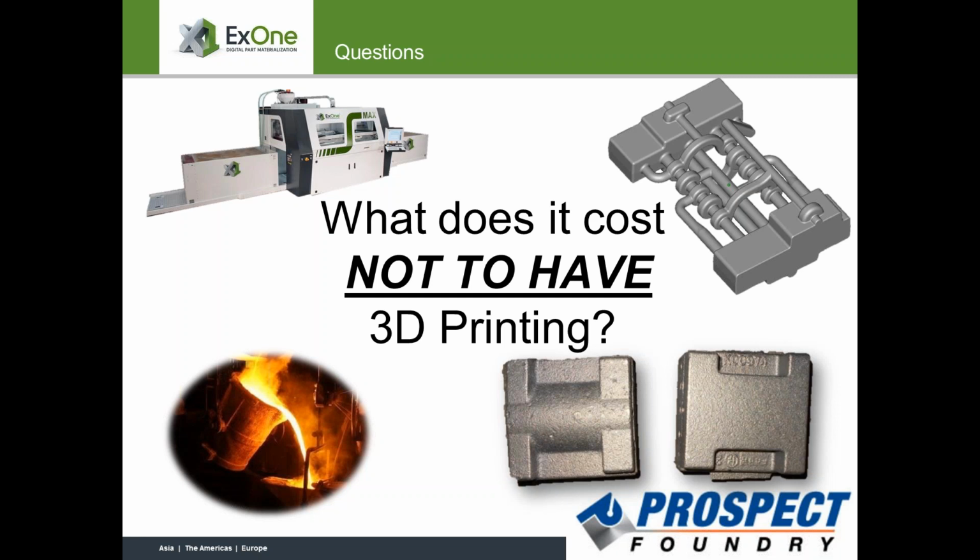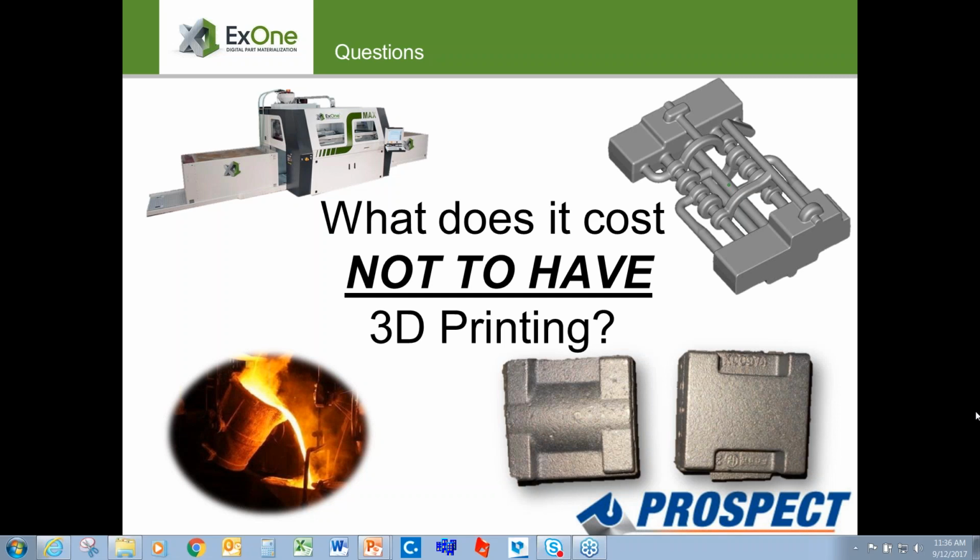And on shakeout, one of the problems we also had besides the gas was burn-in on the shell core. That was eliminated by using the furan sand with the alcohol-based graphite core coating. The lands, the round little hoops on each core as it goes from one end to the other, were getting burned in on the traditional shell. Once we got to this lighter material with the graphite wash, it was able to make a barrier where it didn't burn in, and they shook out. If there was extra sand left in there, they'd tap it with a hammer and it would all fall out.